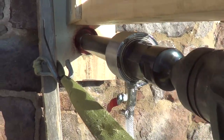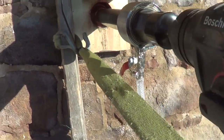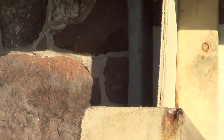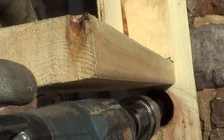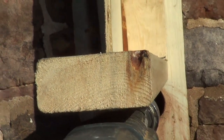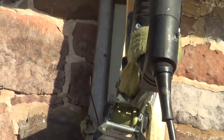Get a little bit of water flow right there, then start spinning the drill — you can spin at full speed. The water is clearing out the debris and keeping that diamond cool. For a hole this deep you want to have a guide. My wood is fashioned where it doesn't move, so I can keep my drill centered about a quarter inch. You also want to drill with the clutch so that when you bind it's not going to tear up the bit or tear up your arms.